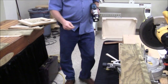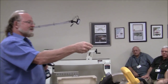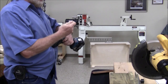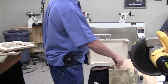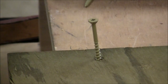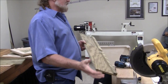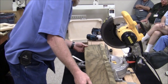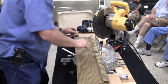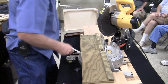Is anybody familiar with what Paslode has done with their drive system? Everybody else is making a star drive in a T25 size, but Paslode is making theirs in T20. So I picked up a box of screws and reached into my box to grab a bit and stick it in the drive, and it wouldn't fit. Paslode decided they're going to change. I've already got this marked, but we always make up these tables and use them for maybe a week, then it gets thrown away. If we're on a job we have to break down every day, so then it's a process of lining it back up. I marked my table, so I know this screw is going to put me right back where I want to be.